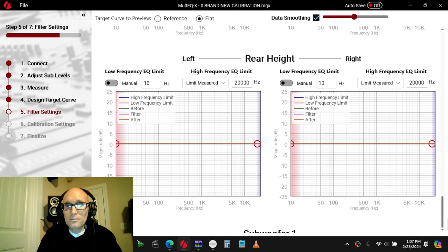And it's just not going to work. So, for example, let's optimize for 30 hertz, because 30 hertz is where all of the slam comes in movers. Look what starts to happen to the response here. Phase traces are misaligned, and it's showing here, so you can correlate this to this easily. I don't just rely on this; I rely on both, and you just have to know both. So optimizing for 30 hertz is a mistake.